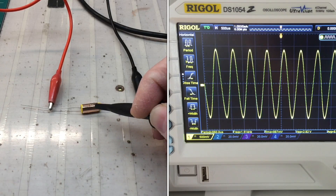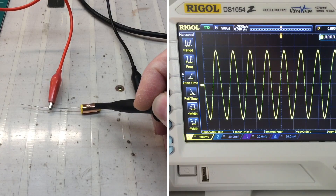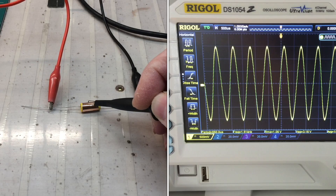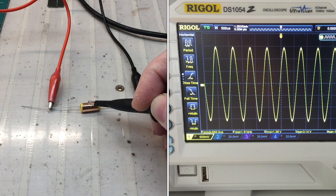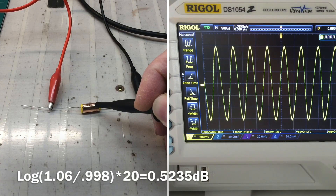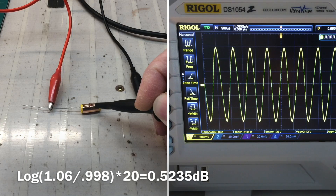I'm going to switch the leads around here on the signal generator itself and you can look at the change. You can see there's very little difference in the amplitude of the signal, and this is one of those low value capacitors. What I thought I would do as an exercise is test a batch of capacitors — anywhere from 3 to 5 for some of the values I had on hand — and chart those out to show the difference between outside foil and the opposite polarity, and what impact that may have for picking up hum or other noise inside the receiver itself.